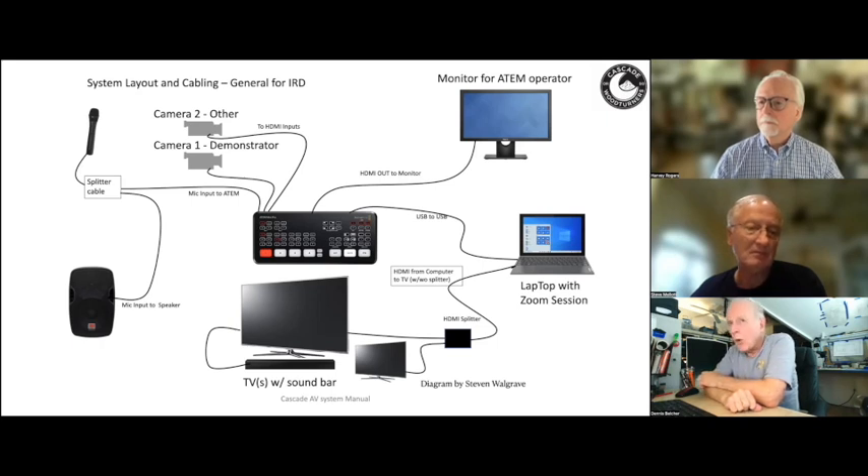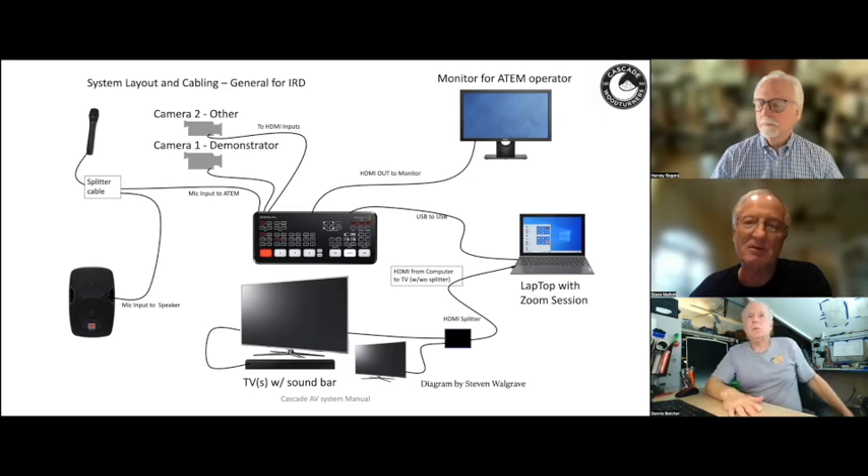The practical guidance: if your sound is distorted, you likely have the headphone output plugged into a line-level input — it's just too high a signal. You won't damage anything as most devices have built-in protections, but it might sound very distorted. Steve also noted that normally you'd need something to combine your in-room mic audio with the Zoom audio — feeding both into a mixer and then running the mixer to the speaker — to get all audio through one speaker system rather than having separate speakers for in-room and Zoom audio.